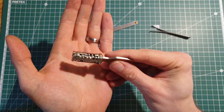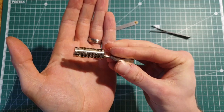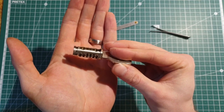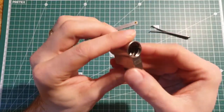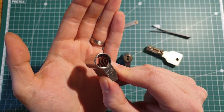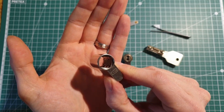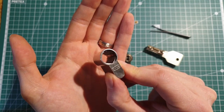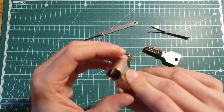If the key is inserted, the sliders might stick out. There's sufficient room for the sliders to move around on the inside, because there are those little pockets, and inside those pockets the sliders can basically be turned around without any problems. However, there's the wall in between those pockets, and this wall prevents the core from being removed in this state.